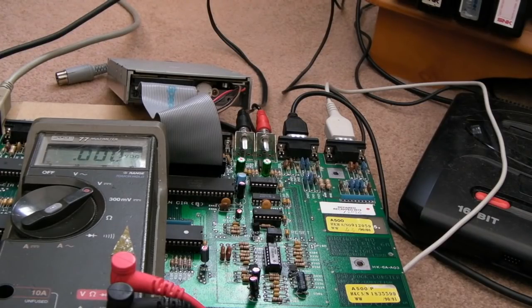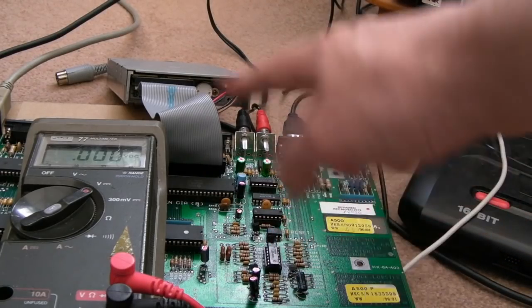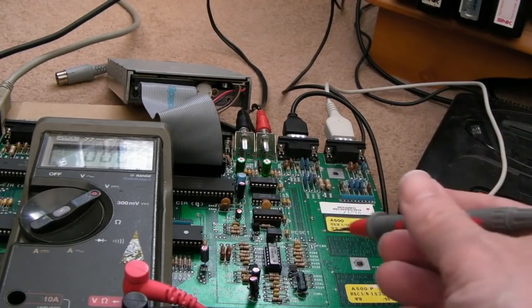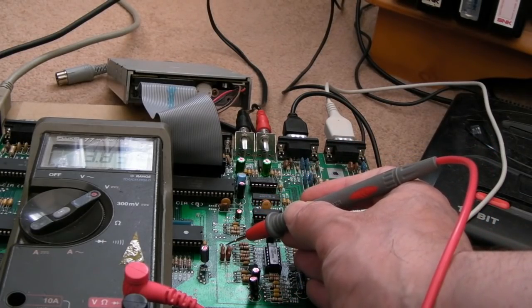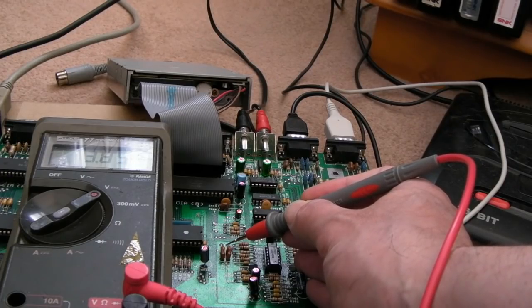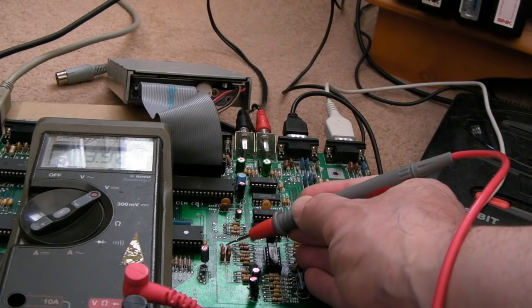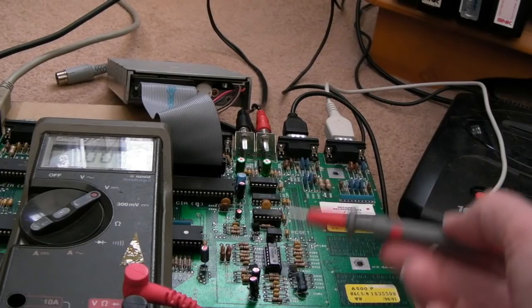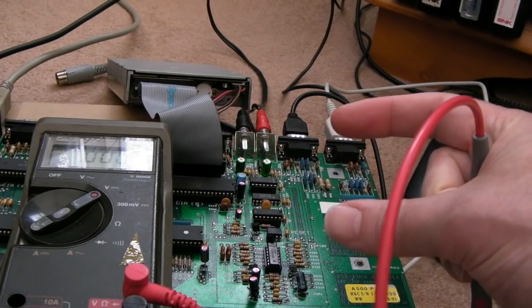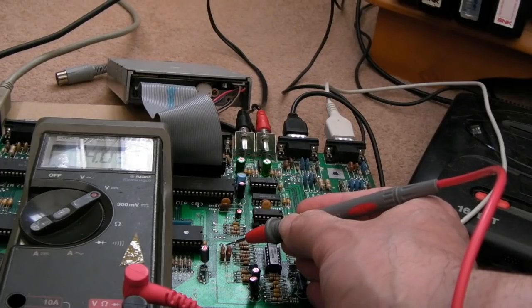Now you may say it's good practice to switch them both off and on at the same time, and that's exactly what we came to the conclusion of at the end of that video. My point being — sorry, a lot of waffling — point being we had some power issues, so I couldn't help but wonder if that's what caused the damage here, maybe something else will go wrong with this board yet. I think it's the legs being short on that chip. And look at that — 3.8 — it is going up. It's not getting warm but it just seems over time that voltage there — look at that, 3.9 volts now, nearly 4 volts — it is gradually climbing. The more it climbs you will get to the point where it will start to distort, because your bias on your audio is shifting your audio level up — you'll start to clip off one side or the other. It's going 4 volts now.